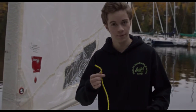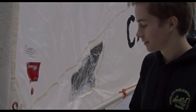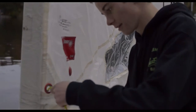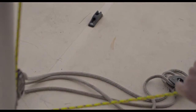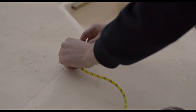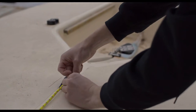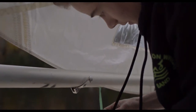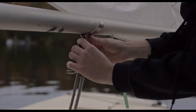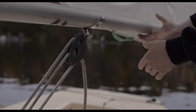Alright, so now we're going to take the other one of our smaller two ropes and use this as our Cunningham — it's kind of a funny word, but basically it's another word for downhaul, which just pulls down on our sail so it doesn't fly up the mast. We're going to take this with another bowline, tie it here, make sure it's nice and tight, bring it down along the mast here into this little fairlead at the base of the mast, and up to this little cleat. It might take a little bit of caressing to get it to go through. Then tie a figure-eight knot, because it's pretty good practice to always tie figure-eight knots at the end of your lines. Push it into the cleat. Another thing we can do while we're down here is put our boom vang in — put it so that this pin slides in here pretty easily, then tighten it up by pulling and getting it caught in this cleat. This will keep our boom from flying up in heavy weather.